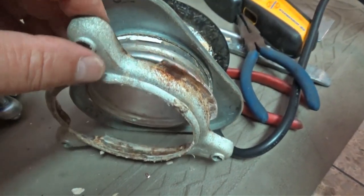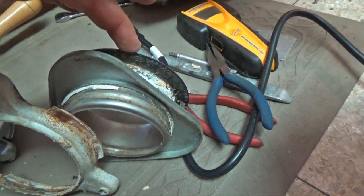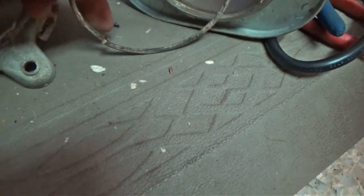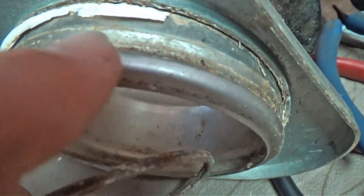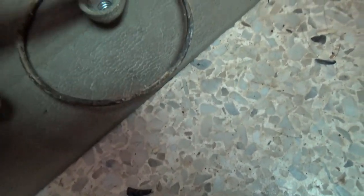It's retained in here by this ring. The ring goes through the sink from underneath — you put this in first, then you put this in, then you lock it by prying this ring. It's not a complete ring, there's an opening so the diameter can increase, and it falls into this ridge. Once it's in the ridge it can't come back out — that's when you do the three bolts. To reverse: undo the ring, undo the three bolts, take it out.